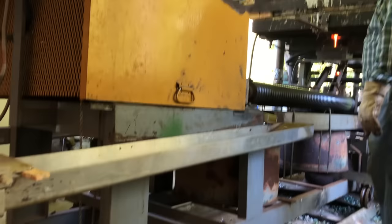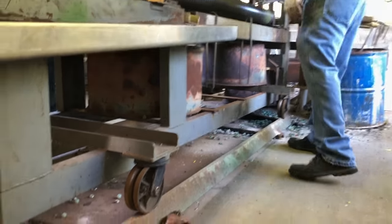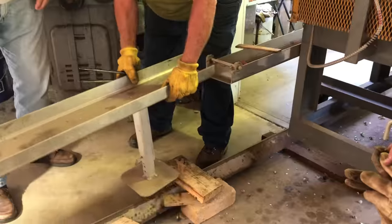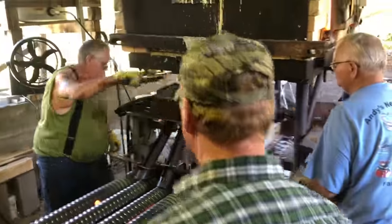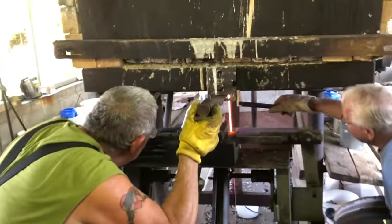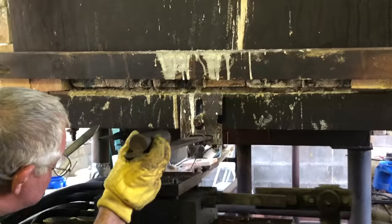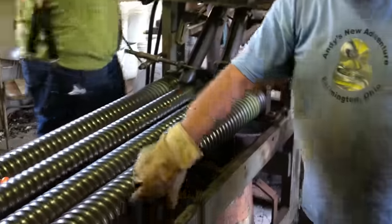This is a view of the support car base for the forming screw section of the machine. You can see it's built on wheels that roll like a little mini railroad train. At the end of the run, the tracks pivot away and the base is rolled forward and away from the stream of glass. The orifice then gets plugged with a wooden dowel and the fuel is shut down. The hot work is done, and the pride of Pennsboro pauses to take a bow.